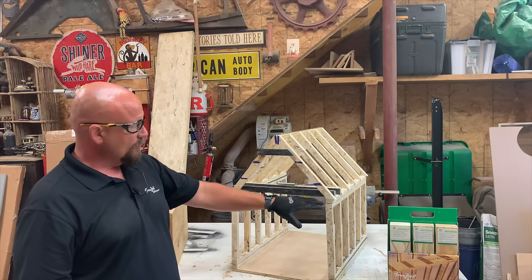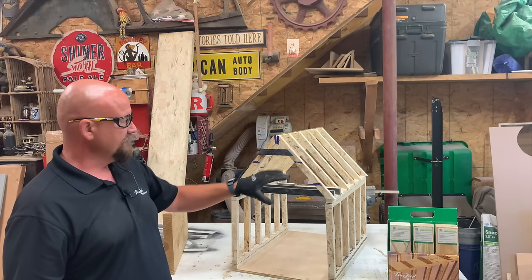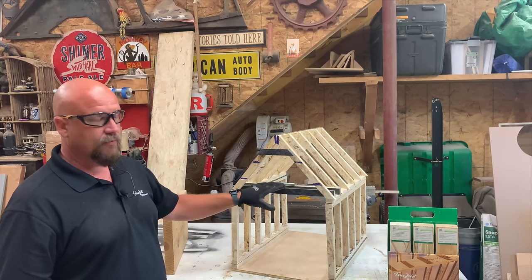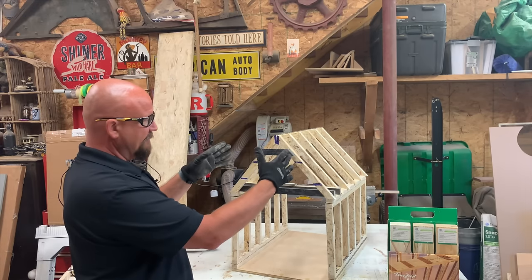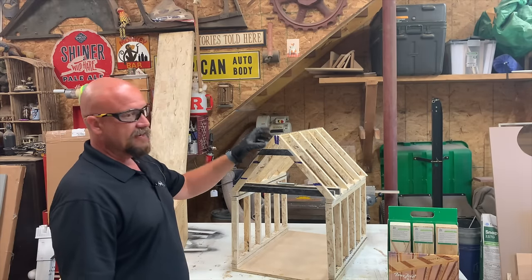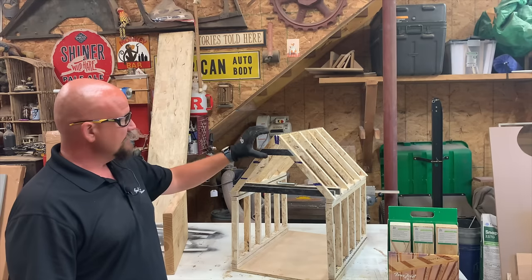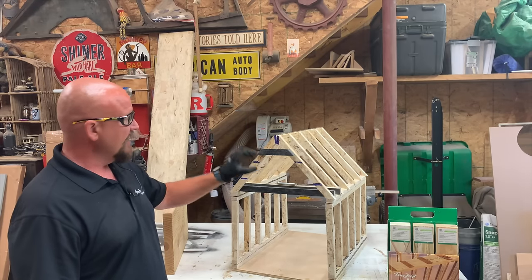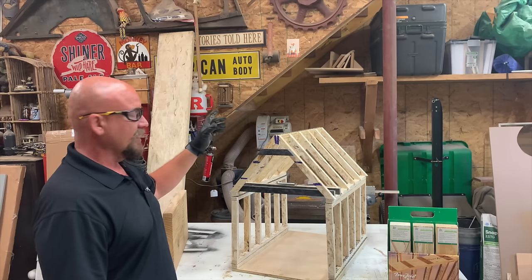We need two different types of applications so that the walls don't push out and the roof doesn't collapse. Down at the bottom, sitting on the walls and up to one-third of the bottom height of the roof system, we have what we call our rafter tie. This keeps our walls in place as the weight from the roof pushes down and out on them.